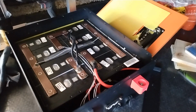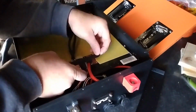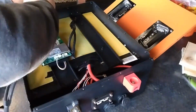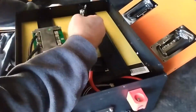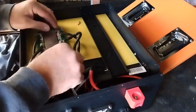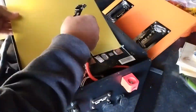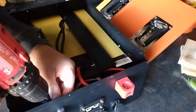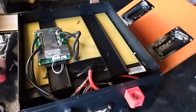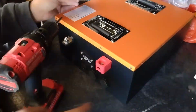They could have gone a little heavier on some of the wiring, especially the Anderson 50 amp connector. What I find is 9 gauge on there, so that's maybe 35, 40 amps on a 50 amp plug. Also, I don't remember seeing any kind of breaker on that. It's connected right to the positive terminal on the inside of the battery, so I don't know that it won't see the full 100 amp BMS on that wire. So they should either put a DC breaker on there, or at least a bigger wire.